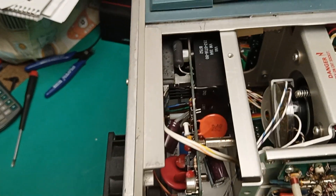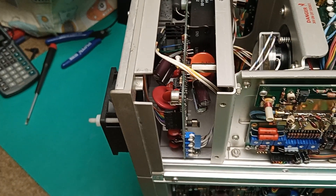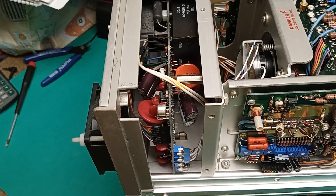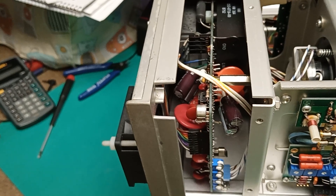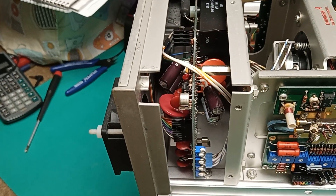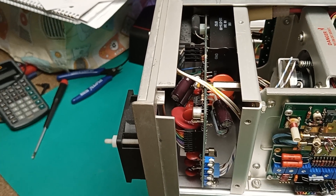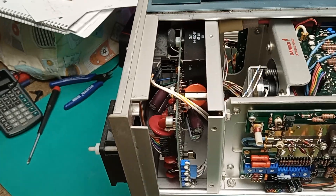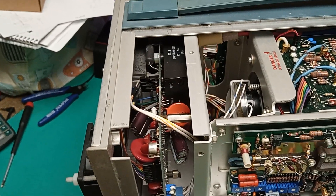What isn't obvious is the potential to destroy this unit from this board back here with the VMI VM-164 high voltage tripler — a high voltage power supply board, analogous to the horizontal output and high voltage source in a television receiver. Bent over in there are capacitors that were either 30 volts underrated or only 30 volts overrated — they leaked all over the board. If that board fails, it can destroy upwards of five special switching transformers. There are tales of woe online about people who bought these and hooked them up, the power supply smoked, and now they've got junk.